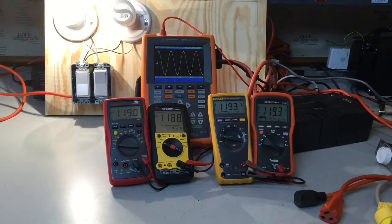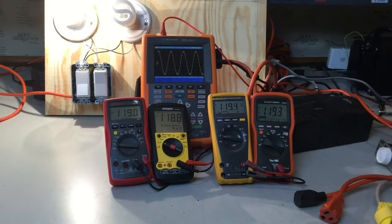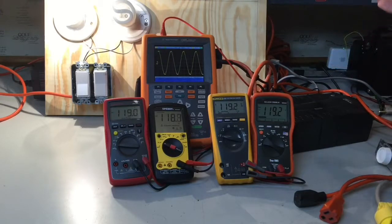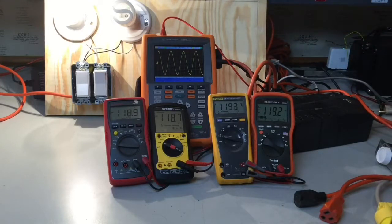If you're looking at a manufacturer who has an averaging meter and then has the same meter in a true RMS version, you're looking at usually 30 to 50 dollars more. So is it worth it to you to have that kind of accuracy for that price differential? It really comes down to what you're measuring and whether or not you're going to be seeing waveforms that are different than a pure sine wave.